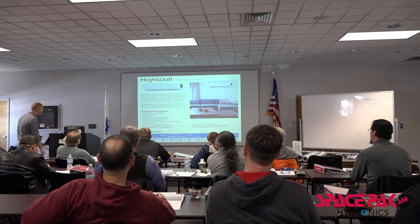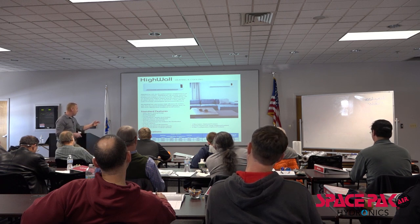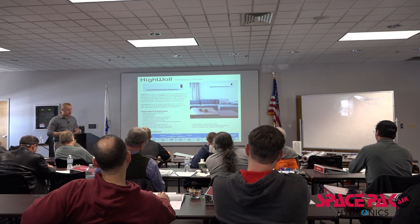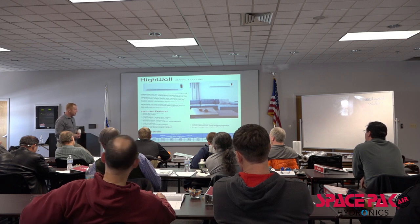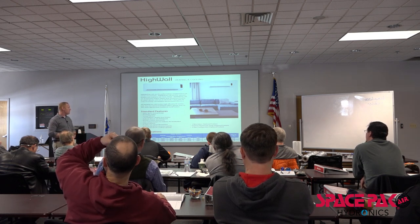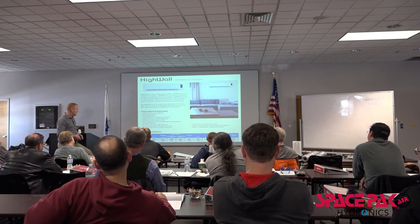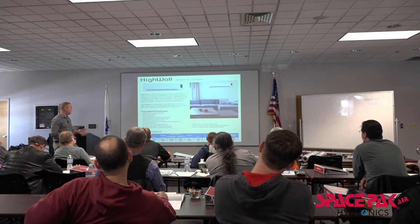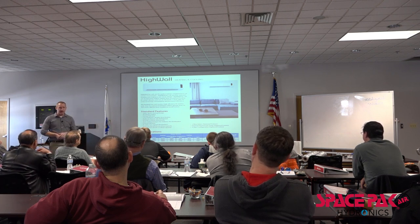Here's our unit again. Looking at this, what I said before, those other numbers were based on 140 degrees. So if we were delivering 120 degrees, our smallest unit would still do 8,000 BTUs of heating, and our largest unit would do 14,000. Now if we went up to 160 degrees, our maximum water temperature, now we use 14,000 and 25,000 BTUs respectively. Our cooling, depending on our water temperature, would be at 45, 47, or 50. If it's 45 degrees, our big unit will do a little over one ton of cooling for that room.